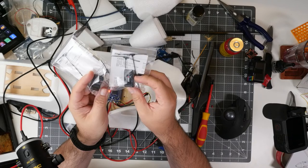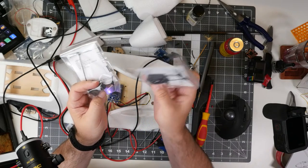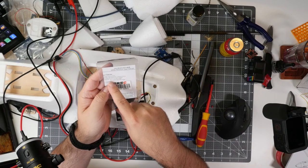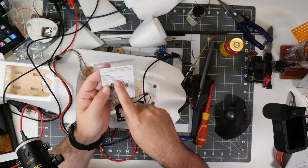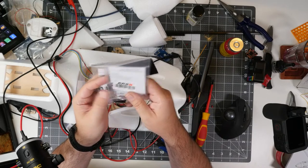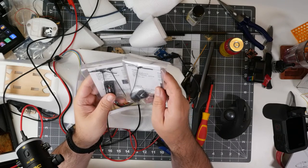And if you are just a fixed-wing pilot with the traditional no stabilization, no flight controller, anything like that, you just put this thing into your build and you are done. And they are HV. I have no idea what the HV means, but they can run up to 8.4 volts, so on 2S without absolutely any problems. So no, sorry, this has 4 PWM outputs and the fifth one is the on-off PWM. I don't know why this is needed, but okay. Yeah, because this is how ExpressLRS works, exactly. But I think ExpressLRS 3 changed that. So this is not a problem.